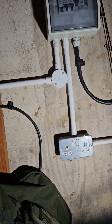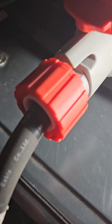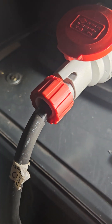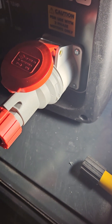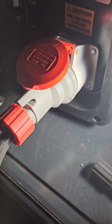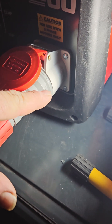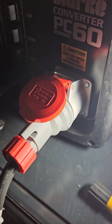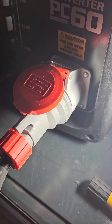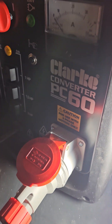So I came back to the machine and wired it into the consumer unit. I took my blue wire, folded it back — you can just about see the tape — cut the end off, folded it back out of the way, and taped it up. Then I wired it: earth is in the bottom, my black wire is in the middle at the top, which is L2, and L3 and L1 is whichever way you get the motor to spin. I originally had my motor spinning backwards, realized it, and switched it around. Plugged it all in and hey presto, it all works.